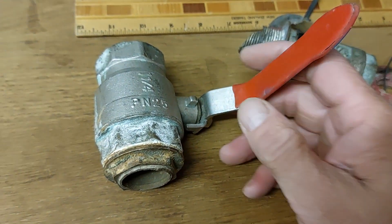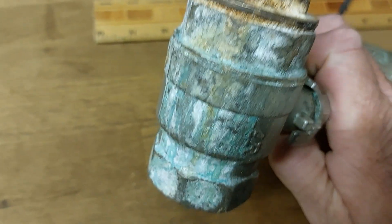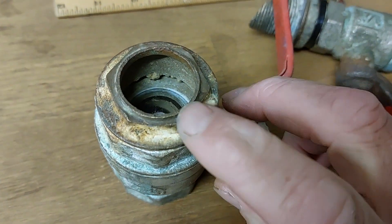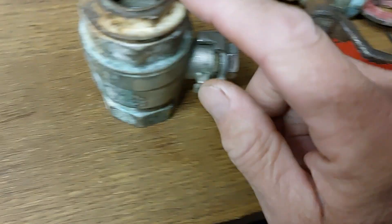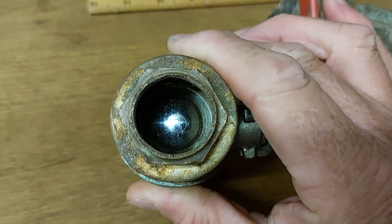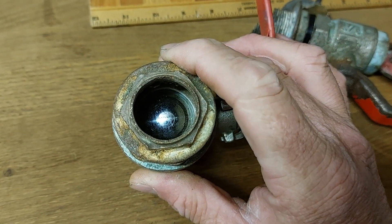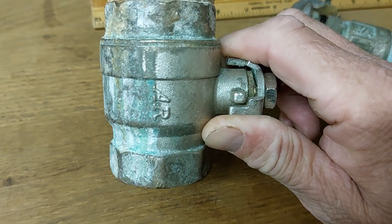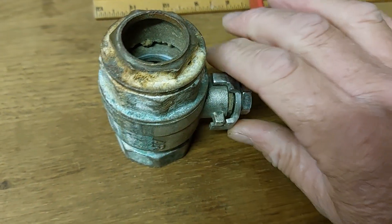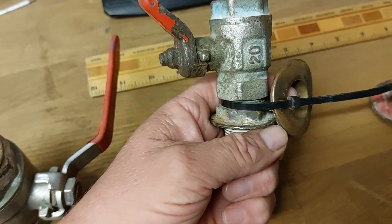This first one, as you can see, has a lot of side corrosion, and it actually sheared off and the boat sank. The hose tail — the section that comes out here where the hose attaches — fractured off. There's the ball, good as gold, but can you see how thin the walls of this fitting are? The valve itself was probably serviceable, but the hose fitting failed when the owner wasn't on board.